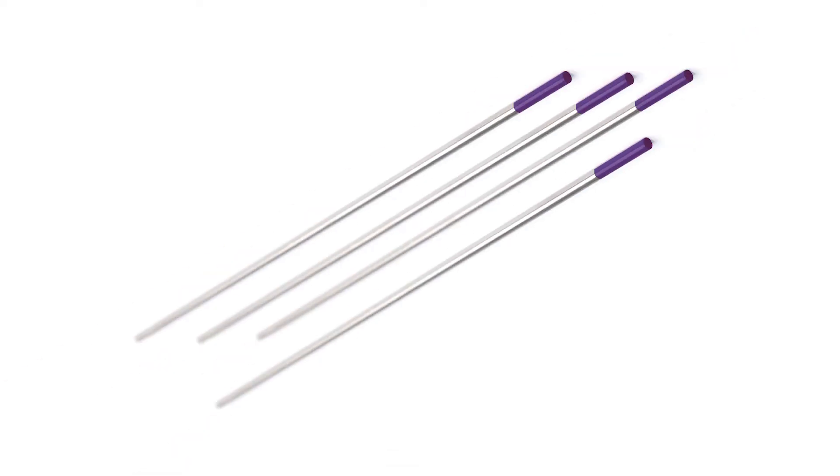When welding with aluminum in a TIG process, your electrode selection is key to creating clean and consistent welds. Your best bet would be to use a pure tungsten electrode to ensure good arc stability. Alternatively, you can use E3 electrodes, which are made of rare earth mix oxides — they consist of tungsten as a carrier material, as well as lanthanum and yttrium as additional elements. Whichever you decide, make sure you prepare the tungsten appropriately.